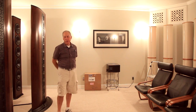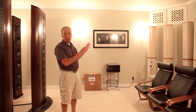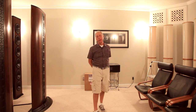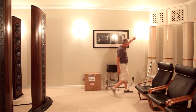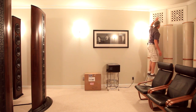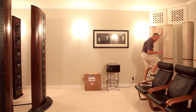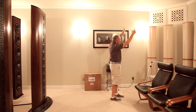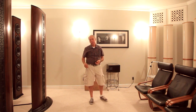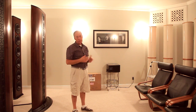Welcome. We are going to tune the room. If you remember in our last video we had the Helmholtz resonators, which are these up here. You'll notice what we've done is we've created a hole pattern in each of these, and behind those panels is a layer of damping material that will take the sound, convert it to heat and dissipate it.